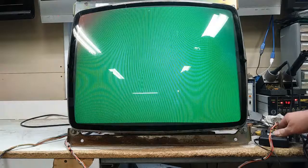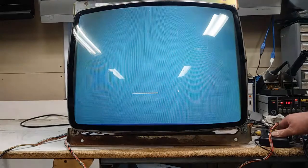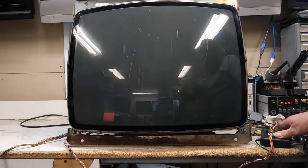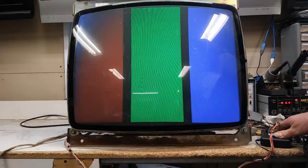Hi, welcome to the Arcade Buffet. We have another 25-inch K7000 — this is for Ernie. Not too hard to repair on this one. Fixed up the cap kit, had some wrong caps on it and finished the cap kit, put a good fuse on it, vertical IC reflow, some trace reinforcement — fired it up and it looks fantastic.